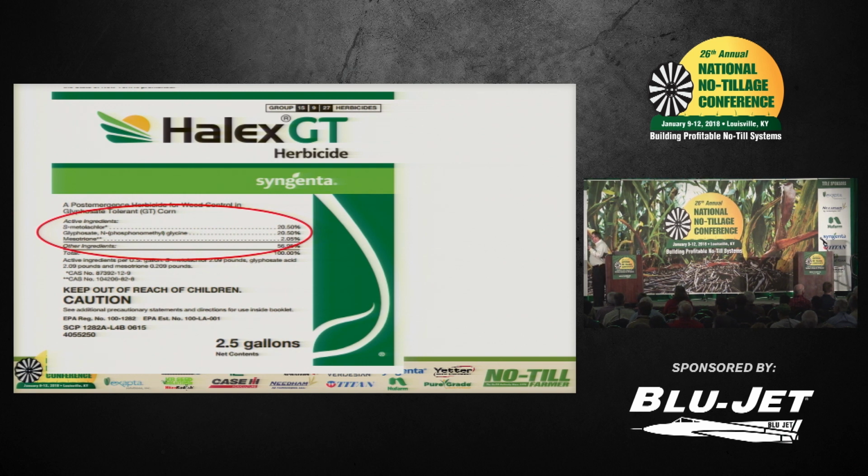There's a potential that those 3 products in that combination do not set my droplet standard very well. If there's glyphosate in there, that requires a bigger drop. If there's anything in there that requires coverage, that requires a smaller drop. How can you put that in a sprayer and set the sprayer to do the job right?